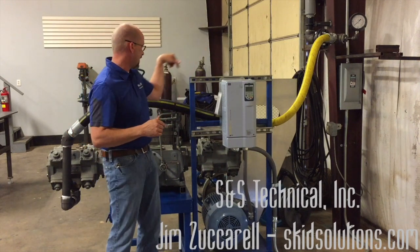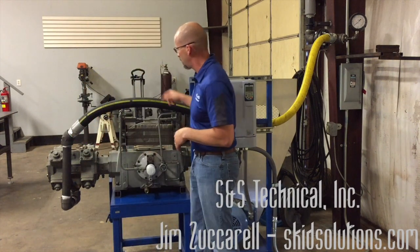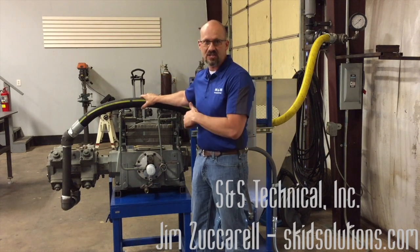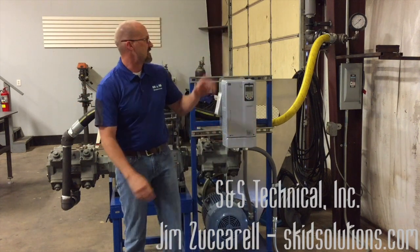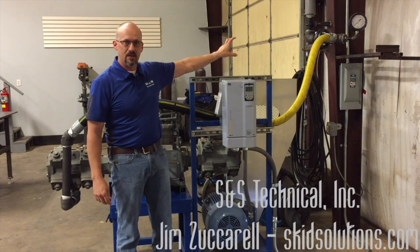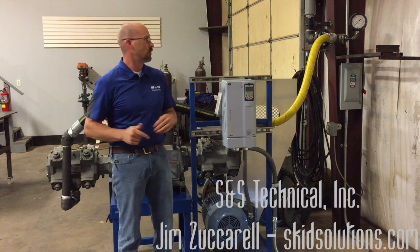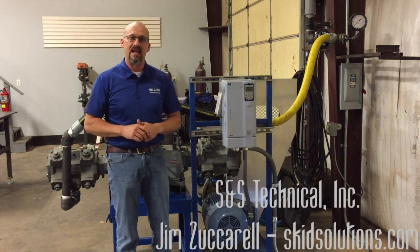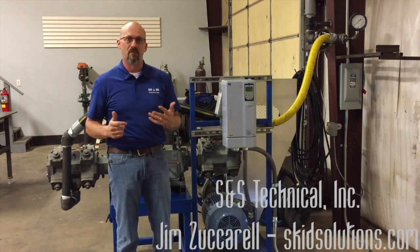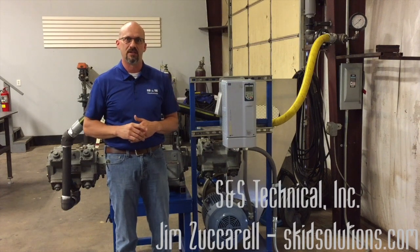We've got a rig set up so that we can actually do an orifice test. In this particular instance we've got a compressor that's got six-inch cylinders on it, and we've got a hose where we can test each side. We have a fixed orifice diameter that we install in the flange located up to the side here, and then we run the compressor at a specific speed. That speed correlates to a particular pressure on the gauge, and we're able to confirm that the rings are seated properly and that we have proper valve actuation going on in the compressor.